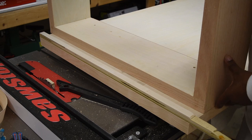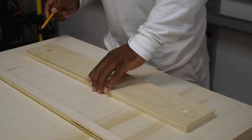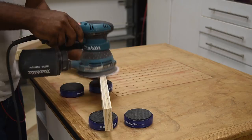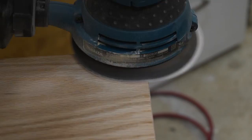The legs can be placed to your liking. I decided to push mine in about an inch from the edge, using a piece of lumber as a spacer, and then traced the inside of the leg onto the top. Next, I traced that piece of lumber in the location where it needs to be mounted, then drilled a few holes in the second undrilled piece so it can be mounted to the top. I also edge-banded those as well. For now I'm going to set those to the side, sand everything down, and get it all prepped and ready to apply finish.